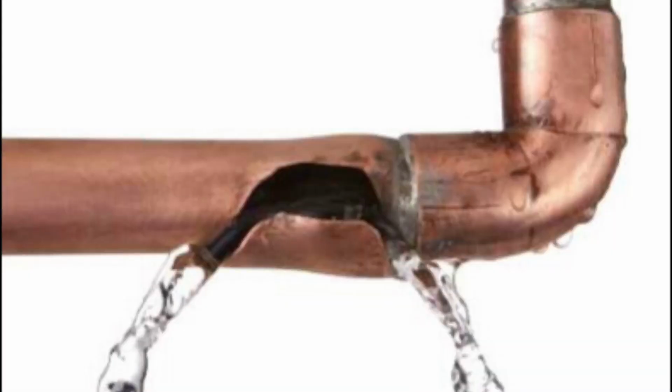It's a good thing to teach the kids and everyone in the house to turn off valves like the quarter turn valves carefully, because they shut the water off so quickly that it can lead to water hammer. It's something a lot of people don't realize, but it does put pressure on the system. You might not even realize it, but it could create a problem on the second floor or the first floor, far away from where you're shutting the valve off. Again, I'm not a plumber, but it is something to think about. So when you have those quarter turn valves in an older house especially, turn them off slowly. It's fun to turn them quick, it feels like a guillotine action, but turn them off very slowly, because that'll help ease the pressure buildup in the pipe when the pressure comes back.